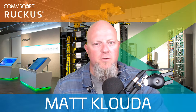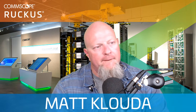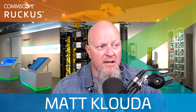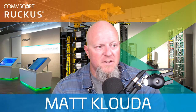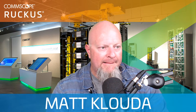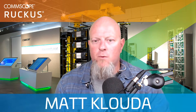Let me pull the data sheet real quick, Richard, and I'm going to see what the power draw is on that, because it's not too much for the 7150. I can tell you that much right now. If the data sheet will load, stand by. Let me find the power draw. Its max power consumption is 12.5 watts.